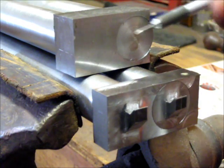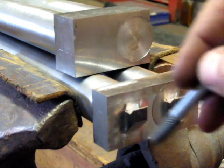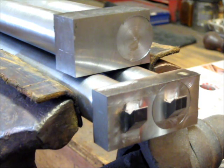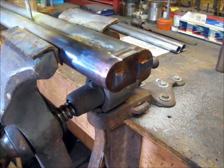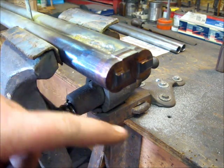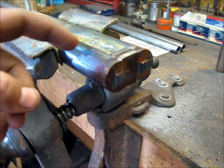Those are the next steps — I've got to make this set of barrels match this set of hooks, then start removing all the extra material on the breech block. You can see this is all round now. The way I did that was I used my mill to knock the corners off the square — I just step milled it — and then I took a file and draw filed it until it matched the contour of the barrel.